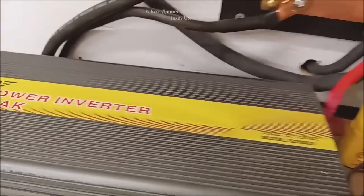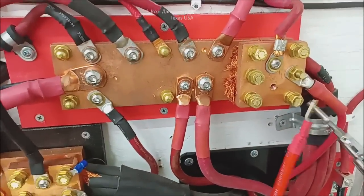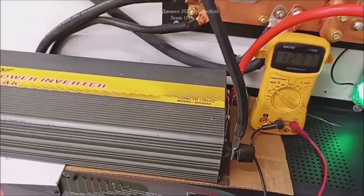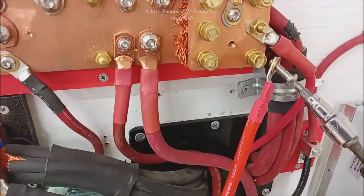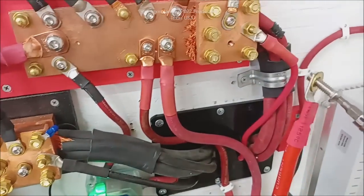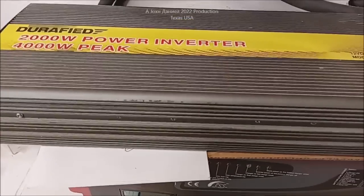You've probably hooked up inverters before, and if you're watching this you probably have or you're wanting to. Sometimes you get to see smoke come right out of them, and the inverter company says 'Did you use safe-start wiring?' Well that wasn't in the paperwork — no warranty. Watch this. You hear that pop? This inverter has 85-volt capacitors so I'm okay.